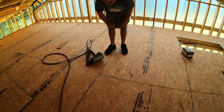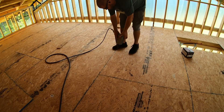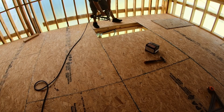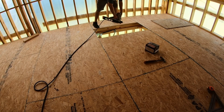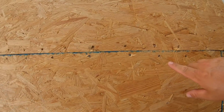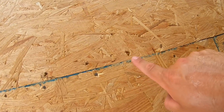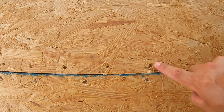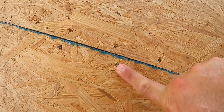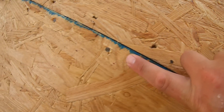Better, but driving a little too deep - I'm going to go adjust it down just a little more. Okay, this is more like what I'm looking for. The nails are barely set in - not where you'd catch them with your feet, but in this instance where I nailed a few days ago I blew all the way through the OSB. These nails are just sunk in perfectly. I'm down around 90 PSI which I was able to easily dial in.